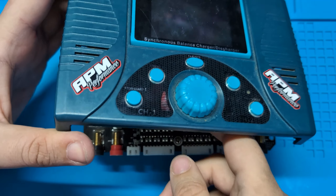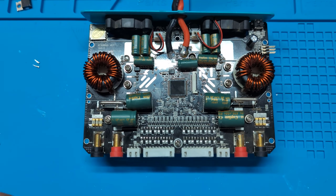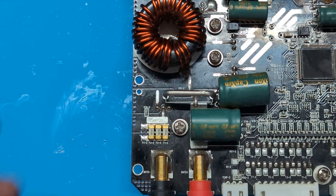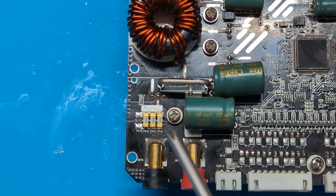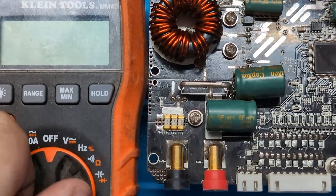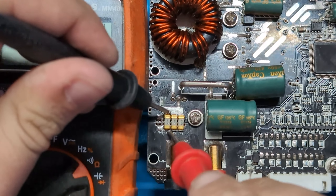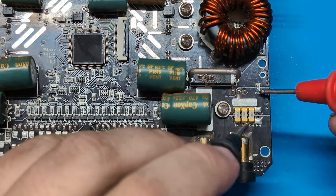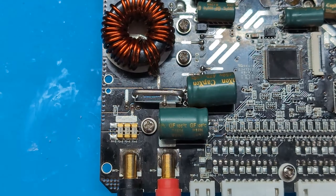So I'll go ahead and lift this display off. I'm going to take a look over here on the left side of the board, and you'll notice we have a couple of fuses — three of them in fact. If I take my multimeter here and put it in continuity mode: nothing. Whereas if we go to the other side, this channel works — you get something, nothing, something. So yeah, these fuses are blown. Happens pretty often.